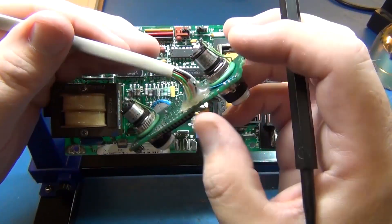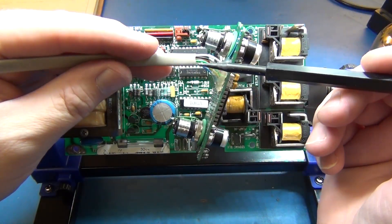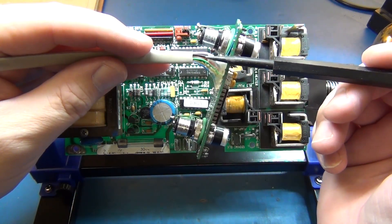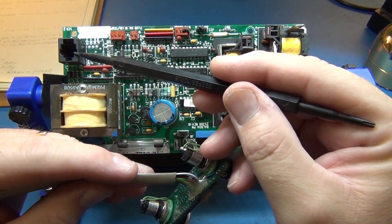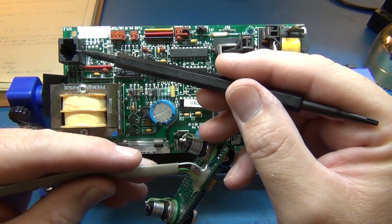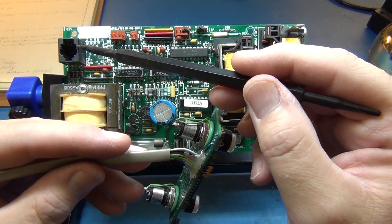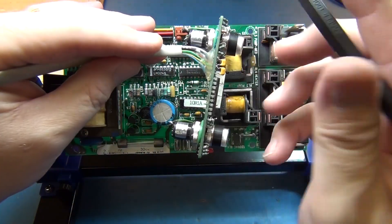There is essentially a 6-line RJ12 jack, and they just use that to make it easy to connect to the board. The RJ12, similar to RJ11s, is for 6-wire as opposed to normal 4-wire. This is 6-wire, so you're going to get some power and ground and a couple of data lines that come up and talk to this PIC.